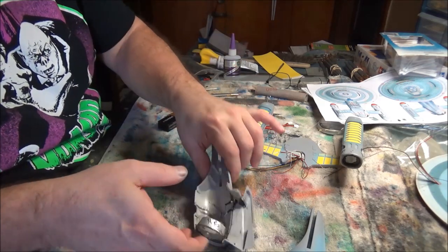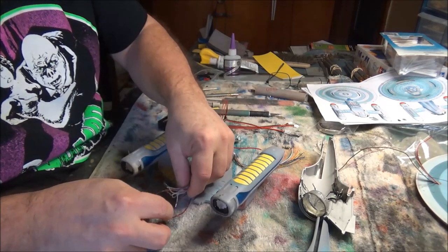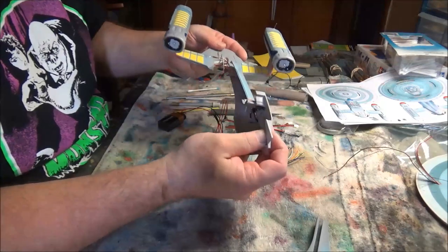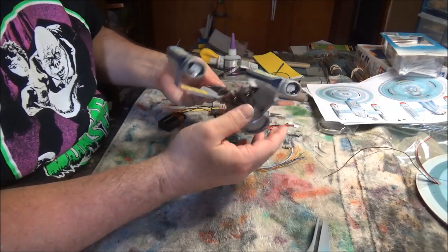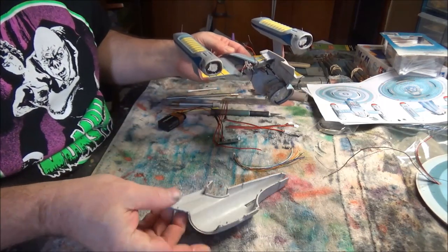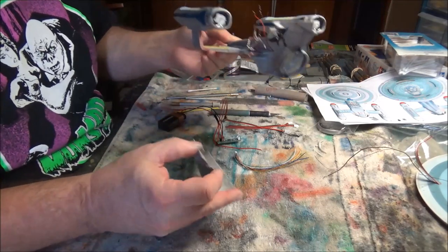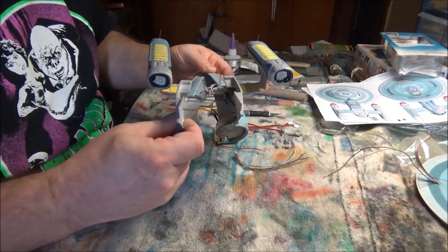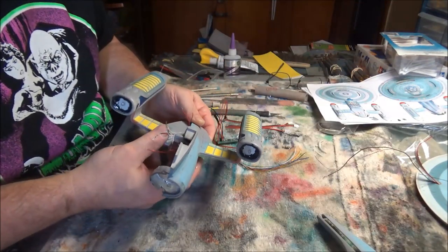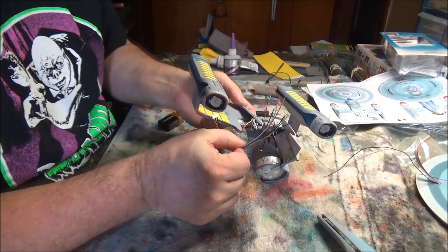So what I've decided to do is this: first of all, I have to take these wires and minimize them as much as possible. I'm going to shorten these down and solder them together so I have a smaller knot of wiring coming out of this assembly. Then I'd like to slide one half on, wire up the board, and then attach - slide the second half in from the side. I've got no connections going on in here, whereas the deflector dish and switch will be attached to this side. I want to be able to slide that one on and push it over and attach it.